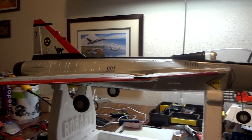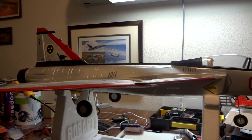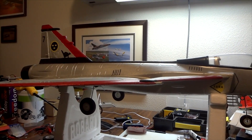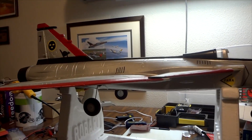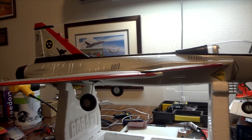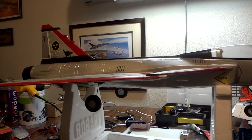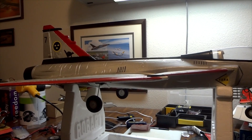It flew quite well for about a minute and 30 seconds, and then the motor stopped and I had to glide it back in. We felt the speed controller and it was pretty hot, so I let it cool down. Threw another three-cell back in, got it in the air, and about a minute and 30 seconds later it conked out again. Back on the bench, one of the leads to the speed controller had come off — almost as if it had a bad solder joint. When I decided to take it apart and re-solder it, all the leads looked like they had bad solder joints, and the heat shrink around the ESC was melted. So I think what happened is I burned up that ESC.